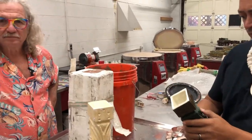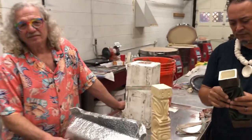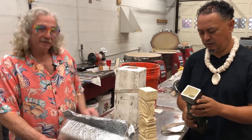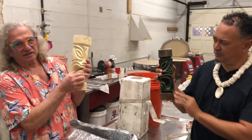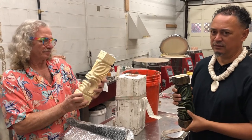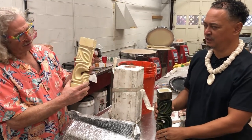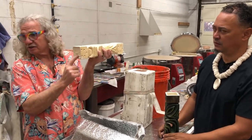I enjoyed watching you guys talk at the bar last night, because I remember when Gecko was telling you about that part of the mug that actually gets really heavy at the base if it's not poured out correctly, right? Right. Because there's that thin portion. Yeah, right. And then what happens is this just gets solid clay, and then this will get sucked in, and then basically you'd start over. So if you're a beginner, just pouring a mold and back pouring it, you won't be able to come out with a nice piece. What's really nice, they're 5-piece molds. There's one for each side and then one for the bottom, because there's a dish on the bottom, okay?